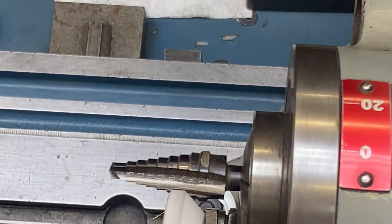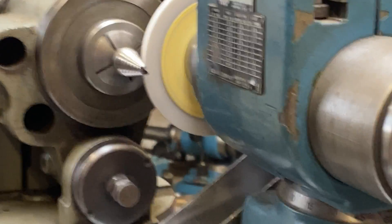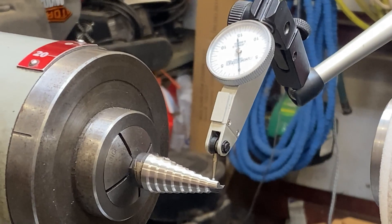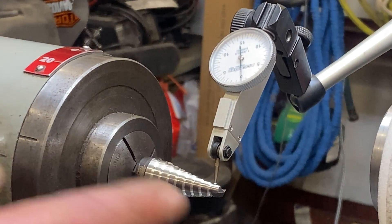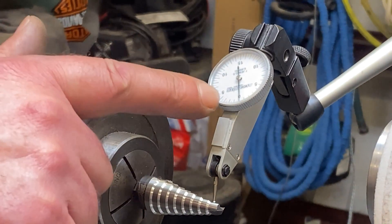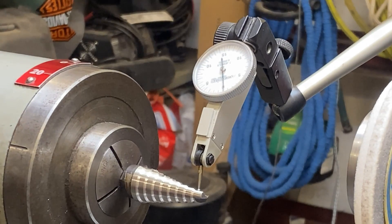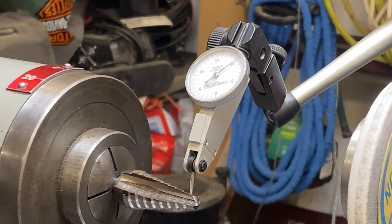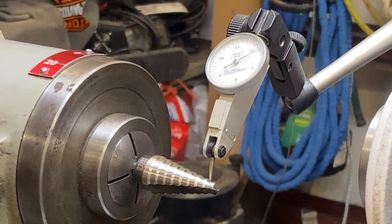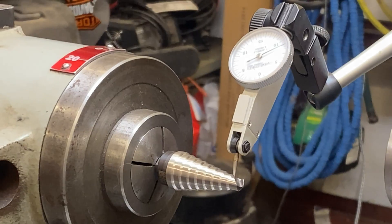Now we're going to dial this and make sure we have relief on it. I have both my axial and radial travel locked out, so this spindle is spinning just round — perfectly round. I've got my stylus right on my leading edge, dial set to zero. We should see that dial go minus as soon as I start rotating it — and yep, there it goes, minus. That's our relief. Now it's topped out — we expected that, we saw that on the cam. We do want to see that we fall off the trailing edge before it gets anywhere near zero, and boom, it's happened. That's perfect — just what we wanted to see.